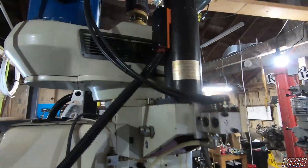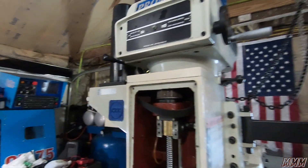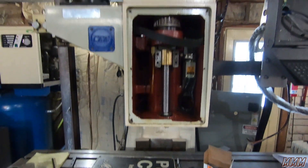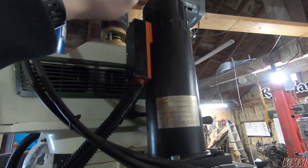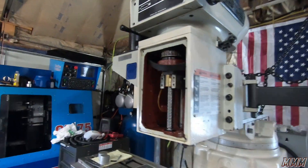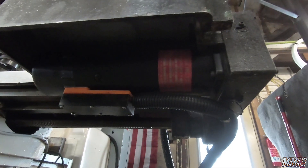What have we done that is new? Well, we have all of our servos. All of our servos are now mounted, although they are not fully hooked up. We had to put in new encoders on them and I 3D printed these nice little two-tone brackets — enclosures for the wires — because they connect in here to the encoders. Those are now on all three of them. We have our Z axis right there, and hidden in here is our Y axis, and down here is our X axis.